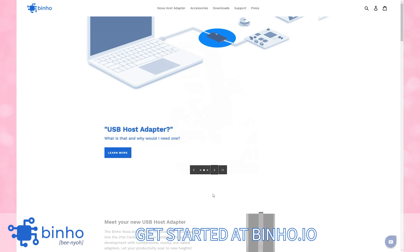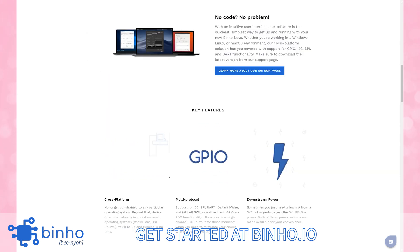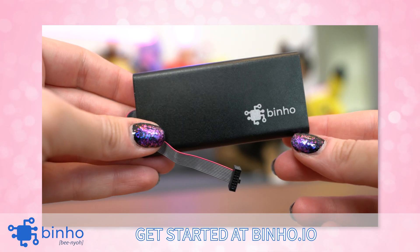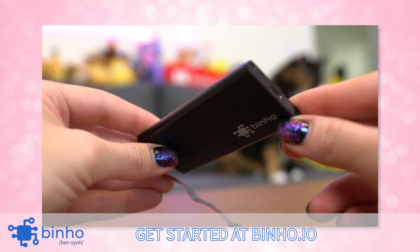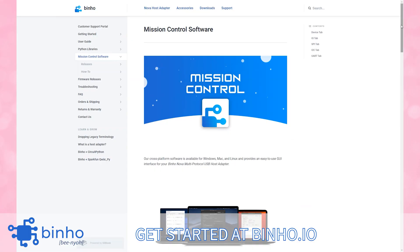With a single slim device, you can interact with I2C, SPI, UART — which is one of my favorites and I've used plenty of times — OneWire, and SWI protocols. The Nova host adapter works where you work. You can simply open up a COM port on your favorite terminal application or even automate control with Python. Binho has accessory boards for ecosystems like Feather and Stemma QT by Adafruit, Qwiic by SparkFun, and MikroBus by MikroE. And you don't have to be technical either.